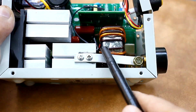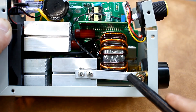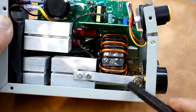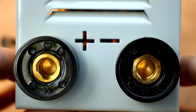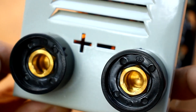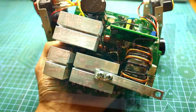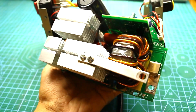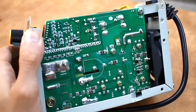We can see the aluminum power bus coming from the radiator of the output rectifier to the terminal for connecting the welding cable. The radiator is aluminum, and the power bus too — everything is clever. But the mount socket is brass. The second mount socket is screwed to the board. The area of the radiators and their dimensions are not bad, considering the dimensions of the inverter itself and the presence of a fan.